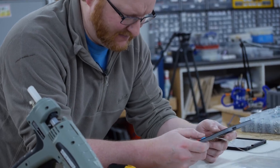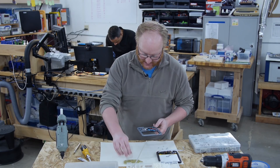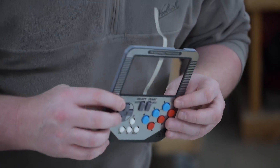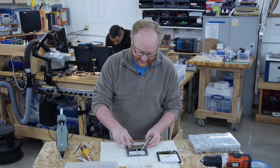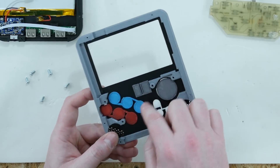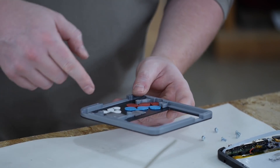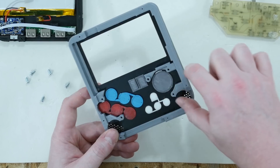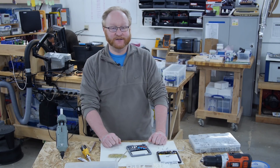The buttons are really loose and I'm not sure I'm happy with that. One of the reasons I didn't put more structure around these buttons was to stay clear of all the diodes on our matrix, but now the buttons are a little loose. I had an idea — the upper layer is well away from the diodes. I was thinking I could go into Fusion and get the pattern of all the outside perimeters of these buttons, then laser cut funky foam to create a nice soft frame around them to keep them in place.